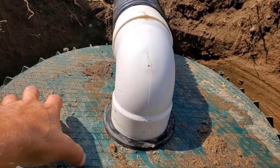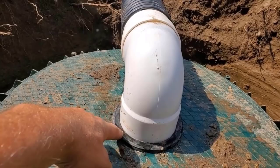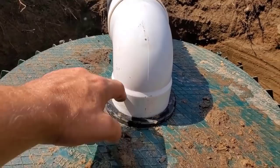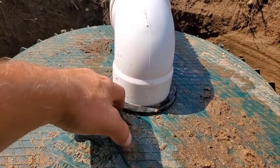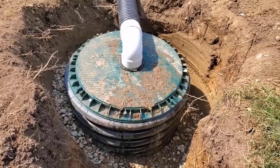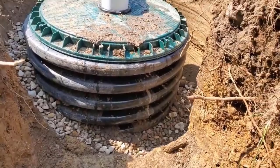So you've heard me say it probably in other videos as well. The cone goes in this rubber. We actually cored this out with a 5-inch core drill. We stick our 4x4 rubber seal in, and you can't get this apart. That cone with the barbed ends, it holds tight. One of our 24-inch lids that fit on a 24-inch dual wall culvert pipe, so that is strong. We drilled a bunch of 1/2-inch holes throughout, and we surrounded it with septic field stone.